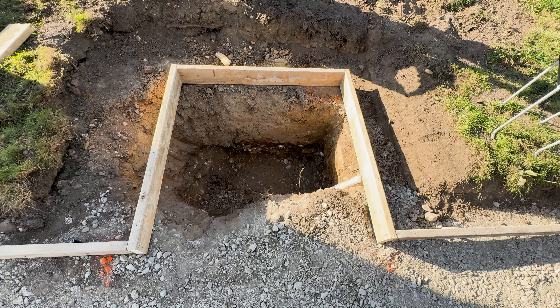That's enough of the patio — let's move around to the driveway area. We're doing this in two pours: the patio area and the sidewalk in one day, then a second pour for the driveway. The forms are up over here for the driveway. On this side we won't need a buggy because the concrete truck should be able to get down here, make the turn, drive all the way to the end, and pour concrete there. As we get close to the end we'll form it up quickly and the truck will use the chute to finish up.